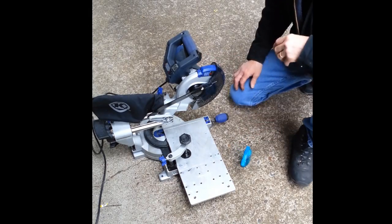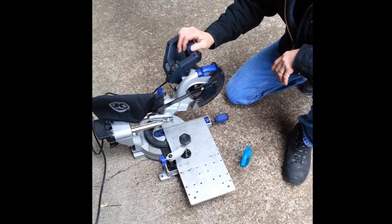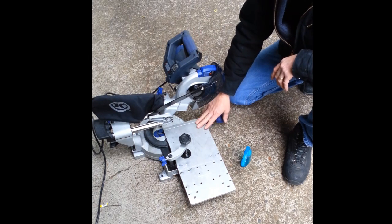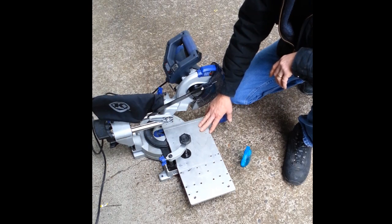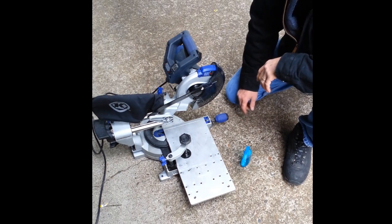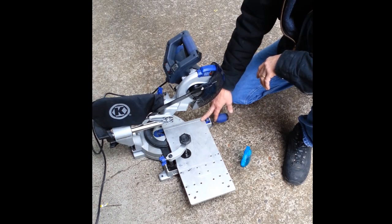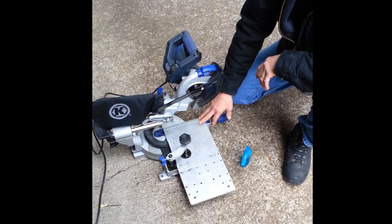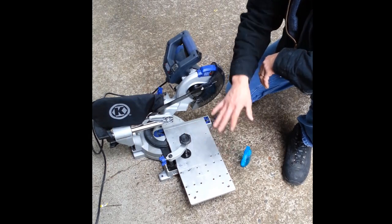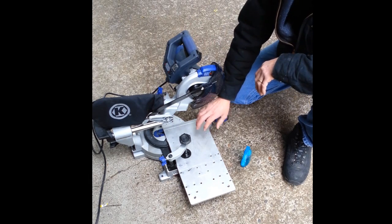I'm making a video to show working on this project. One of the biggest obstacles is doing it yourself as far as trying to cut aluminum plate. This is a half inch aluminum plate, eight inches wide. I've got a sliding miter saw — I tried this with a regular chop saw going really easy, don't really suggest it. Even being super careful with it bolted and clamped down on each side, it still caught a piece and shoved it up into the blade, which was pretty scary.